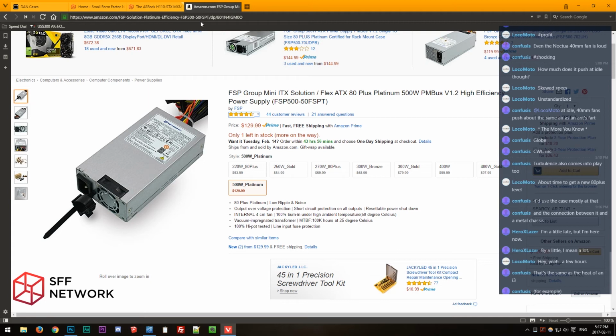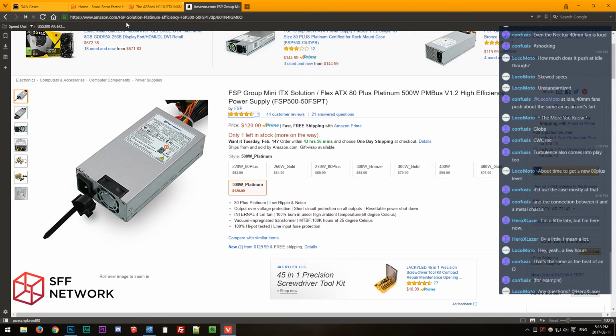It's a good point. And yeah, that's an interesting thing: processors, whether it's a CPU or a video card or anything like that, do not do mechanical work. They're not like a fan where it converts electricity into physical motion. So all the power consumed by a processor gets converted to heat. I see a lot of misconception where people talk about wanting to reduce the heat of the CPU, so they're reducing the temperature, but they're not reducing the heat output, because the heat output is the same, well, to a degree.